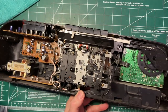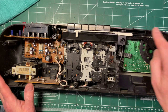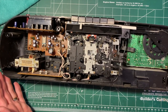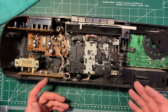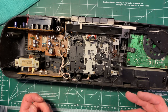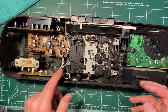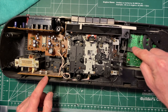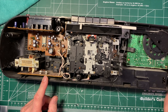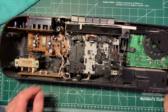So that's helpful. I have a project which I've been thinking about of putting an input jack into an existing radio that doesn't have one. Because then you could take a lot of these old radios and make them useful. You could plug it into a computer, you could plug it into a Bluetooth receiver, right? My feeling is you just have to intercept the left, right, and the ground leads here, use a switch plug, put the plug around somewhere, probably over here, and then you could put it on radio and then override the radio by plugging it in.